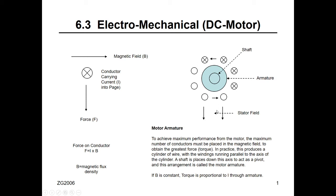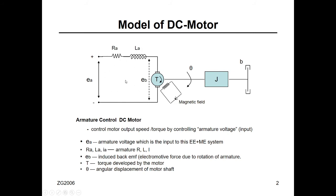The more current through the cable, the more mechanical force. If this mechanical force acts in a circle, it creates a torsion — a torque applied on the rotor shaft — that makes the shaft rotate. This arrangement of the windings is called the armature. On the circuit diagram: the applied armature voltage, the resistor of the armature, the inductance of the armature, and the back EMF — the induced back EMF voltage — represent the transition from the electrical to the mechanical system.